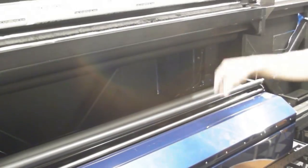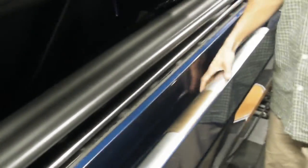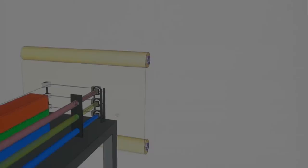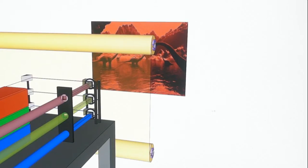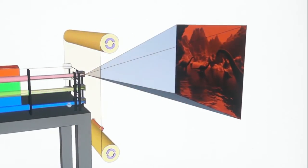When the hologram is in the printing process, we can see the projection of each holopixel on the wall behind the film. Each of the pixels of the LCD represents a viewing angle of a holopixel. The horizontal pixels correspond to the right to left viewing angles, and the verticals to top to bottom.